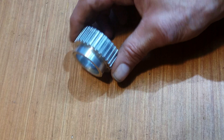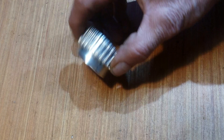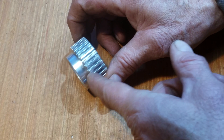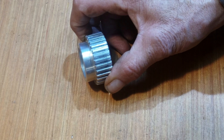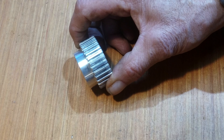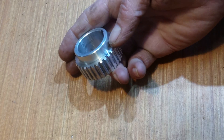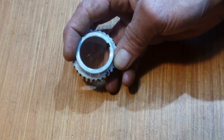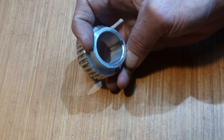These pulleys are readily available and they're not expensive. And if it ever gets to a point where they're not available, I'm not messing around with the cogbed — it is simply this boss on the end that I'm taking a piece off, and it should be easy enough to make a spacer of the right size. So for those three reasons I've talked myself into the easy option — I'm just going to part off an eighth of an inch and use that as my spacer, properly dimensioned with a keyway and so on. Let's crack on and do that.